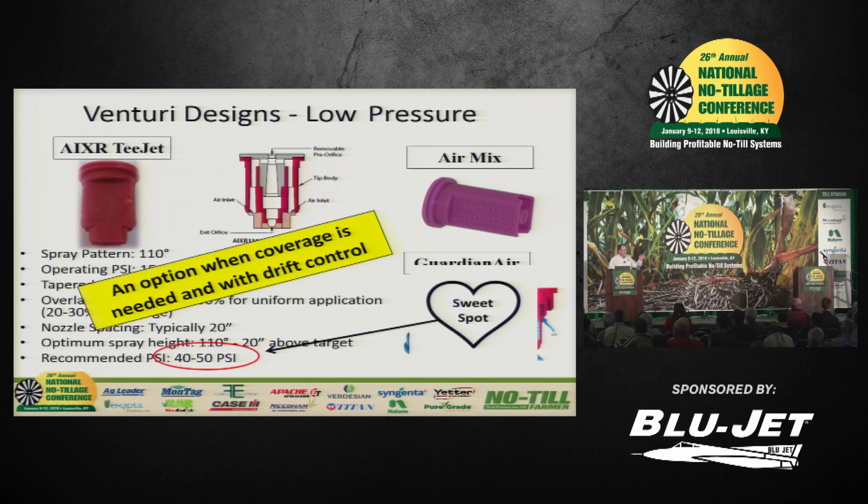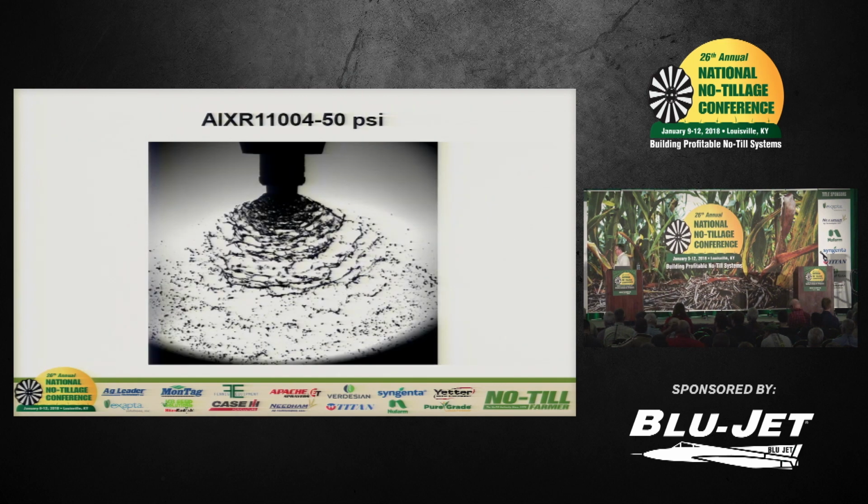Now this is an option for coverage. You just have to understand you might be using it at 50 psi instead of 25 or 30. And with that option for coverage, it has less drift potential than the Turbo T-Jet. So that would kind of fit into a scheme here. Now let's go with this picture, and you can see there's bigger droplets, still a few small ones, not nearly as many.